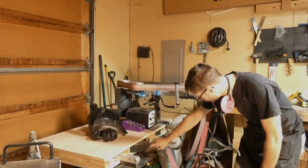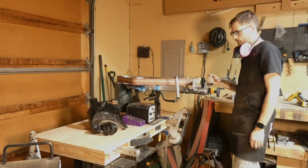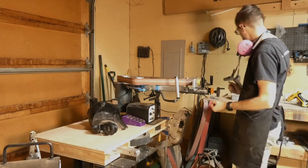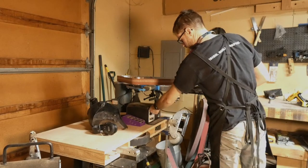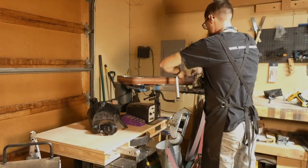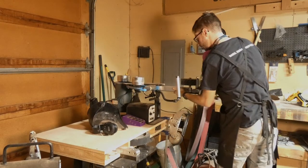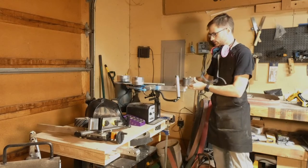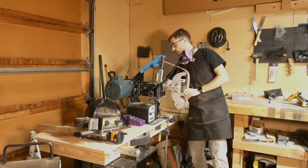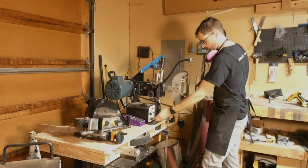Let's go ahead and bring it out — I like to grind when I stand. So what I want to do now is demonstrate the Black Fox 1 Pro electric tensioning system and switching over tools from the SGA to our contact platen. To do that, I've got to turn on the machine power, then I can use the electric tensioning system — decrease tension, take off the belt, remove the surface grinder attachment, set it vertical, add the belt back on. You just want to keep it loose until you get the belt on, give it a little extra tension, lock it into place, and then increase the tension.